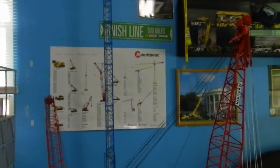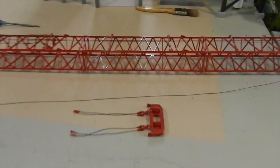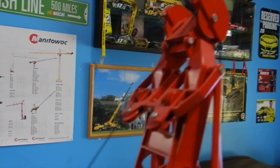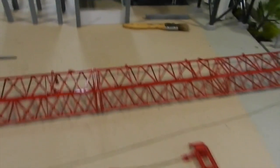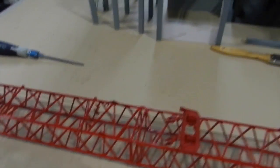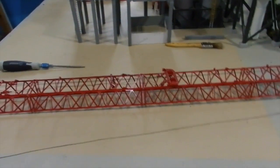through all the sheaves, but leave it on this top one. I'll pull all the string out real quick and then we'll come back to it. Alright, now I have all the string taken off except for this top one. It's still on that. There's all the string. Now I'll connect the pendants, connect these. And then I'll show you how to reeve it.